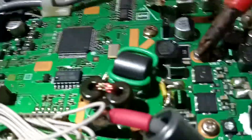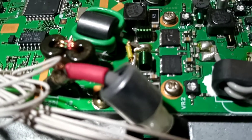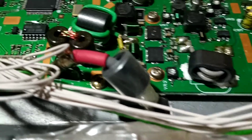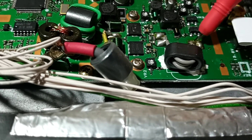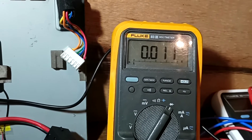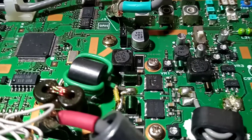So the plan is: buy a new heat gun, change these transistors, find the reference test points for the idle current bias, and check the presets — which are here and here. Off the top of my head I don't remember exactly where the test points are. Just confirming on diode mode: the top one that was hot reads short, and the bottom one that was not hot reads 0.34 — that's all good. When I get my heat gun I'll upload part two.